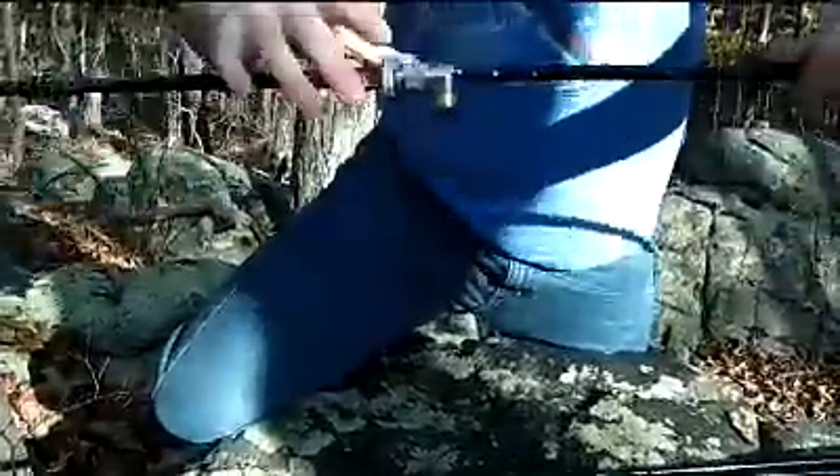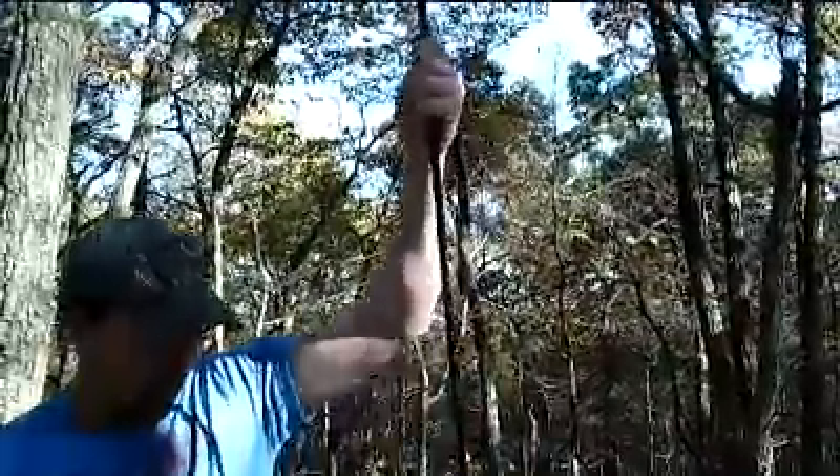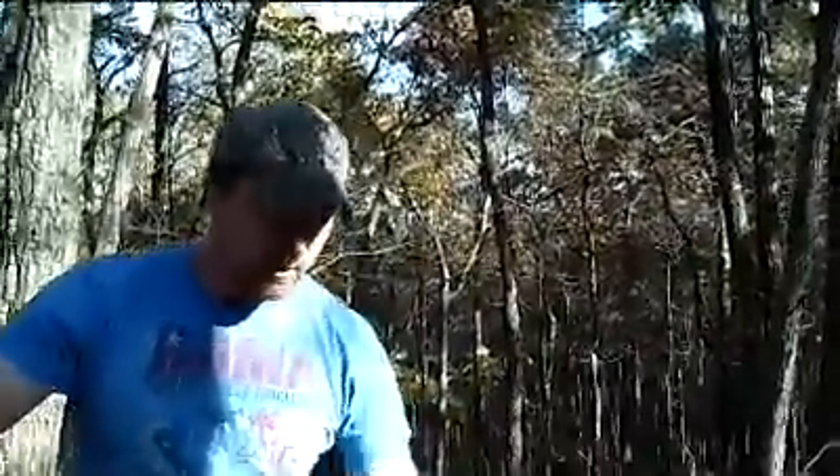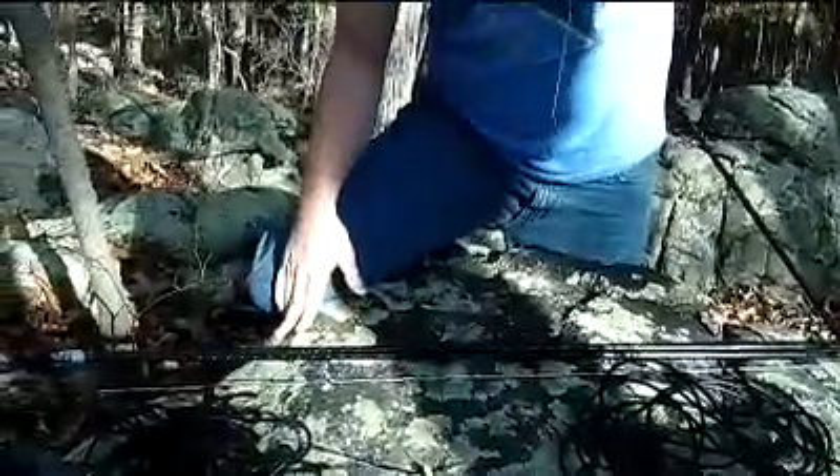Now if I was going to run this horizontally, I would want to get this up as high as possible, but sometimes that's a challenge. It's really frustrating because your ropes get tangled in the trees. So what I'm going to do is mount it vertically with the top whip up in the air, and the bottom whip — after I put these stainless steel whips in — is only going to be about a foot off the ground. I'm going to get a great SWR match and a really nice low angle of takeoff with my radio signal, and hopefully I can get some good DX today.